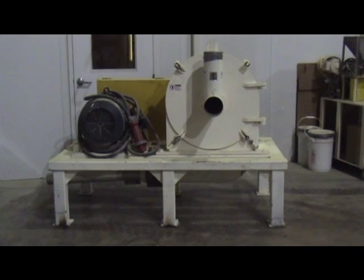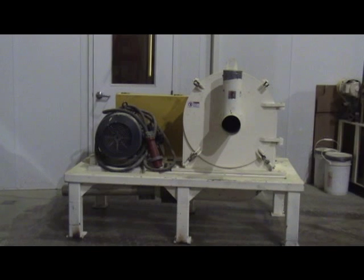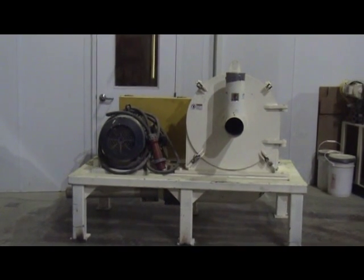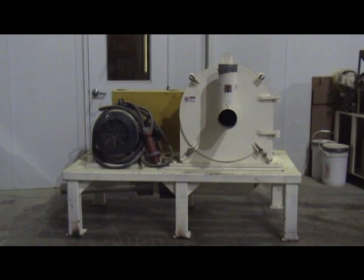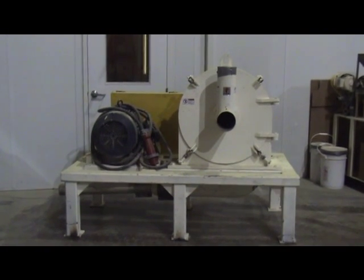Presented here is the Prater fine grinding mill. The Prater fine grinding mill is ideally suited for pulverizing brittle, free-flowing materials into fine powder. All mills are built onto a raised base as shown and intended to operate using pneumatic air. Pneumatic air is utilized to control dust, minimize temperature rise within the mill, and to transport material from the mill to a collection point.